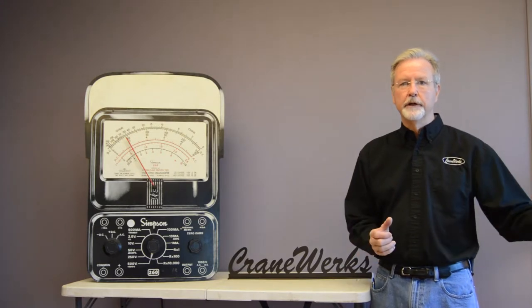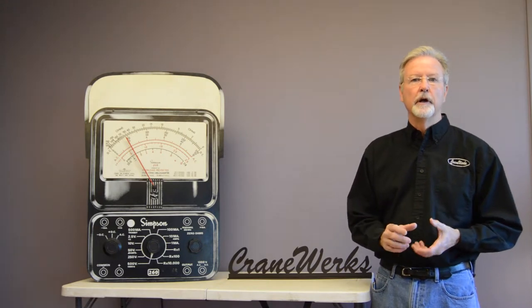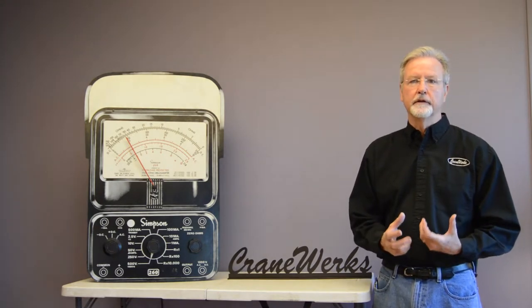They are simply a symptom of a problem with wiring or different electrical components within the crane that are drawing over current. A fuse acts as a guardian. It actually opens the gate when there is an issue with too high of current that might damage other equipment within the crane. So they never blow or fail on their own. Some event, such as high current draw or shorts, those types of things, cause the fuse to open and to protect the system at that time, acts as the guardian.